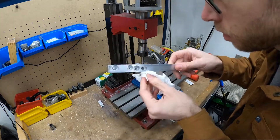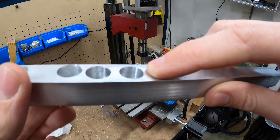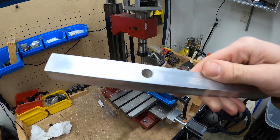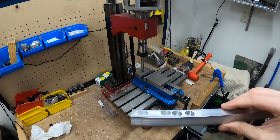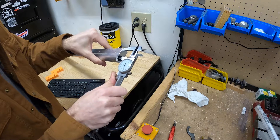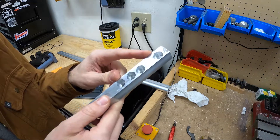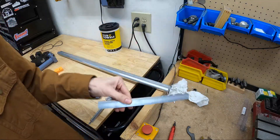I didn't totally ruin the part — it was at least reasonable to run the ream through, better surface finish than just doing it with a drill. This hole right here is not bad, you can see where I bottomed it out. I think an injector will seal on that — that's a success. This one went all the way through because I updated the part and this is only 3/4 inch. The fuel rail is actually just over — 0.820 — so I made the program for that. I'm going to call it quits there, that's good enough especially with the ream cleaning up the surface finish.